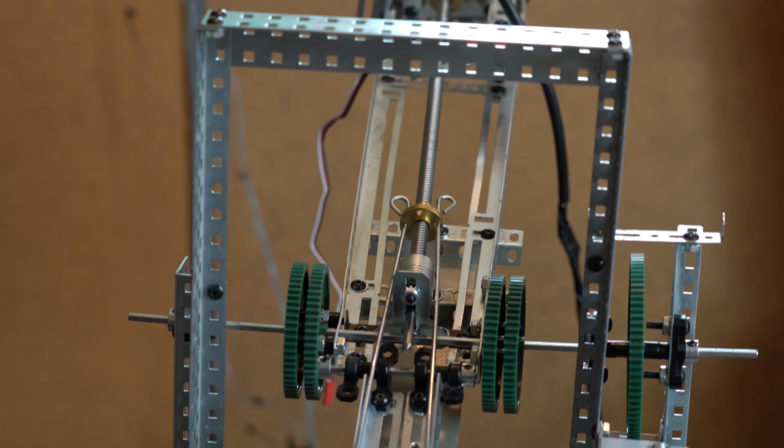When I did it with DC motors, it was very strong. I needed limit switches to stop it in time, because when I didn't, it would bend those push rods. And those push rods are very thick and very sturdy. They're the thickest ones that I could buy at a hobby store. They are very strong. And yet the mechanism, when it was directly driven with the DC geared motor, bent them. I don't have that problem with the stepper motors, though, fortunately. And in fact, I don't even need the limit switches, because I can move that arm very precisely using stepper counts.